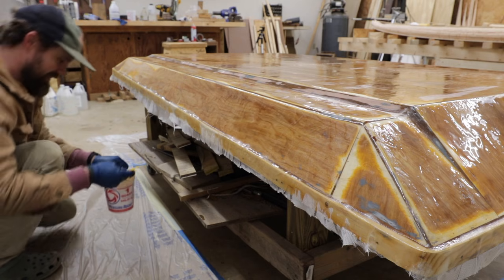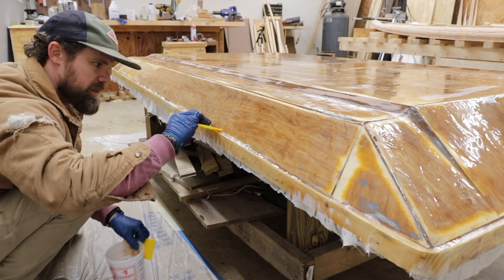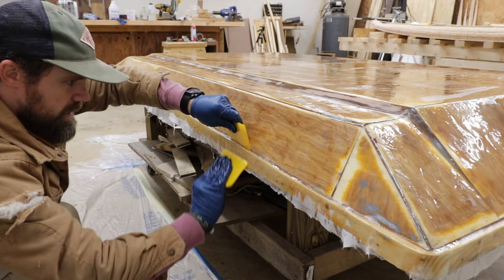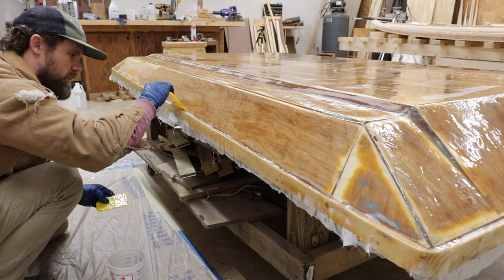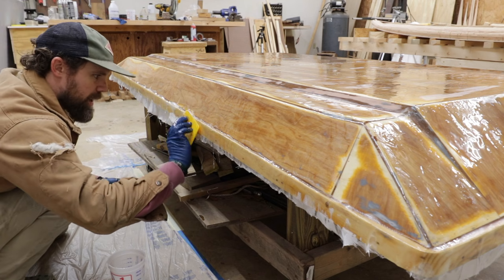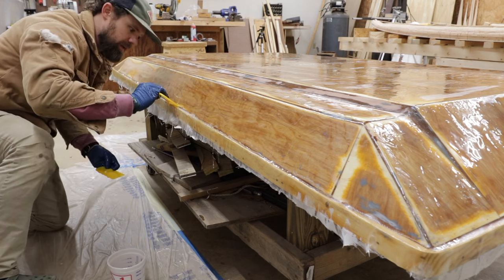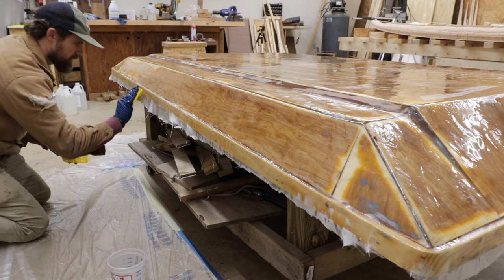This is a bit stressful. Working around the corners, making sure everything stays down. Sometimes the cloth wants to lift in the indentions — when you press here it can pull away right there. It's nice to have two squeegees to press into the corner so it stays down, then squeeze downward to wet out all the sides. Once all the cloth is saturated, go around the whole thing repeatedly making sure there are no air bubbles and nothing is lifting up weird in a corner. I can feel the epoxy starting to heat up, so it's coming to the end of its workable life, but we're almost there and it's looking really good.